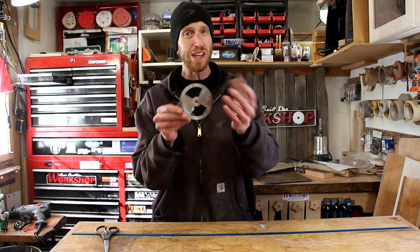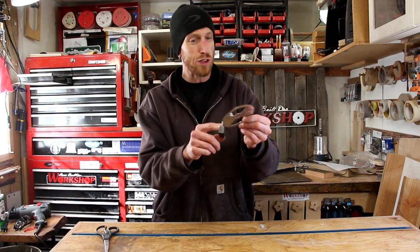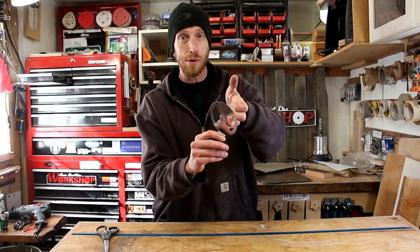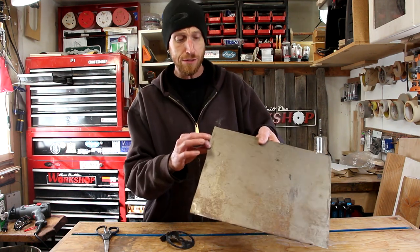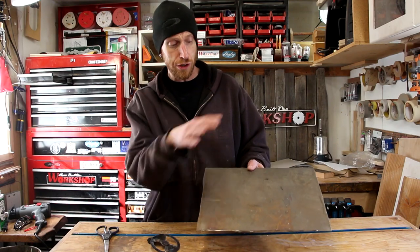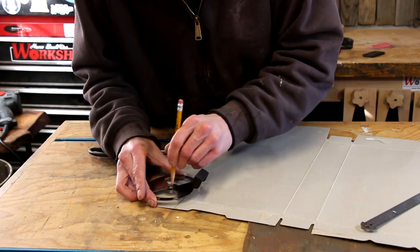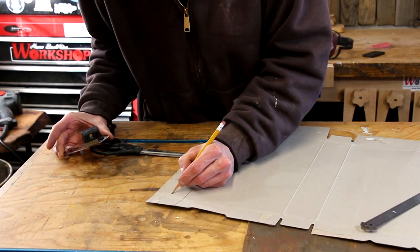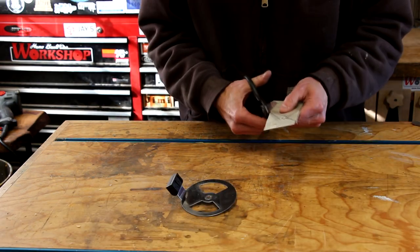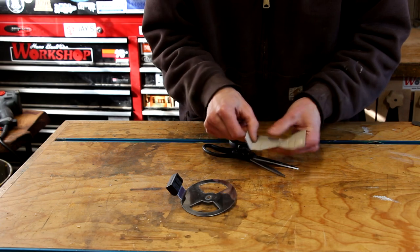All this piece really is is a thin piece of sheet metal, probably stamped out on some sort of a press. We are not even going to make it as fancy as this — I just need something to cover up the holes on the grill and to be able to open and close it. I searched around and found a piece of sheet metal. It's a little bit heavier than this, but I think it's going to work fine. I can still cut it with some sheet metal shears. I'll begin by making a rough template on the back of a cereal box. Cereal boxes are great material to keep on hand — I usually have two or three laying around that I can use for templates. So next time you empty a box of cereal, break it down and stash it aside. You'll be surprised how many times that cardboard will come in handy.